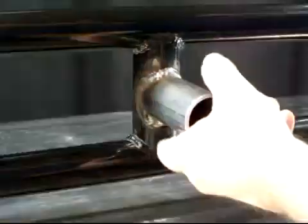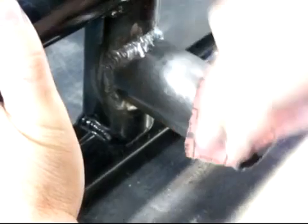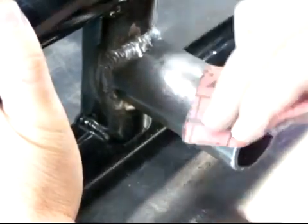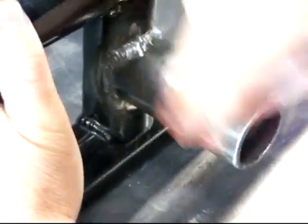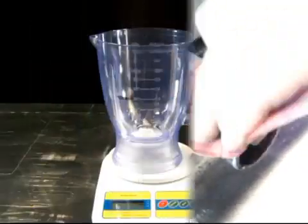The process is simple. The part must be completely clean and free of oils, grease, corrosion, and other debris. Etching can be done with a sandblaster if available. However, sanding the part with coarse sandpaper will achieve the proper surface etch.